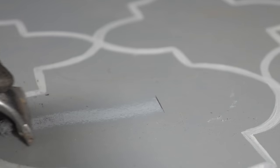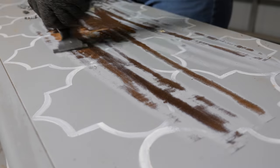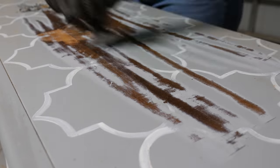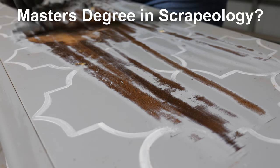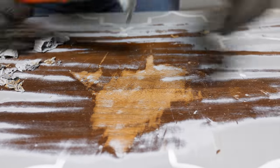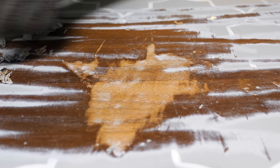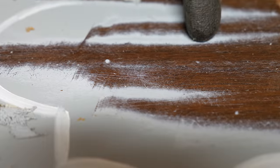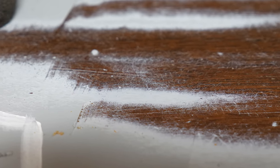Next, I'm going to use my 2-inch carbide scraper to remove the paint. Paint hides what's been done to the original finish underneath, and the carbide scraper will function as my archaeological dig tool to uncover what has happened under the layers of paint. Here's a primary example on the top of the dresser — it looks like the finish was damaged by something, which may have triggered the initial refinish. You can also see swirl marks on the finish, which means the surface was scuff sanded before the paint was applied.